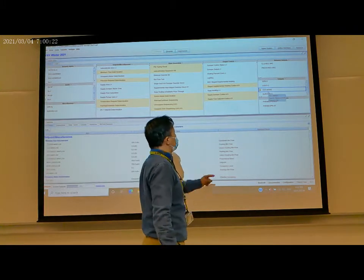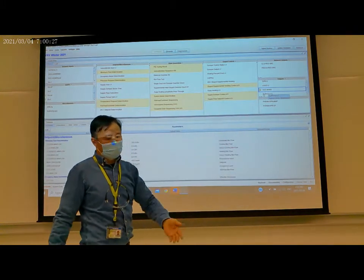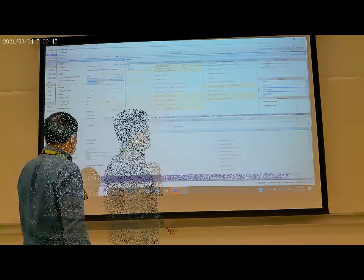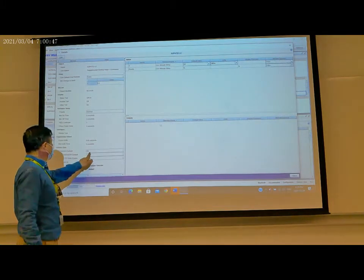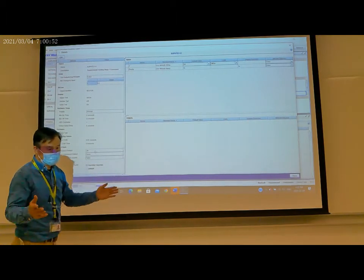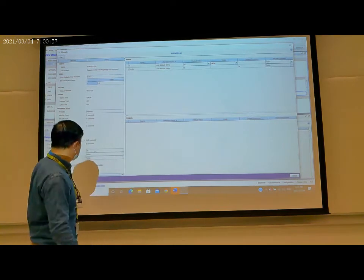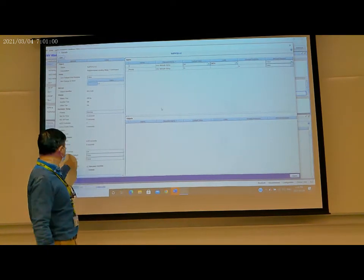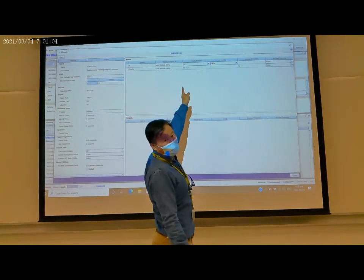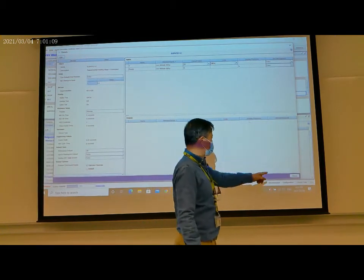And here, this is the heating. The controller will turn on a heating system. For this heating system, the default is off. No people, or the schedule is unoccupied, and then it's off. So the default value is off, and the units are on/off. So it's correct. So we close it.